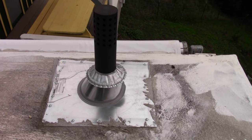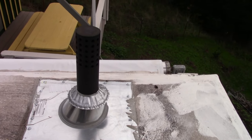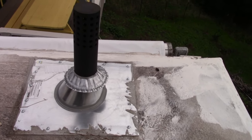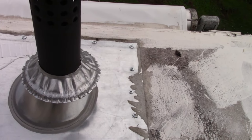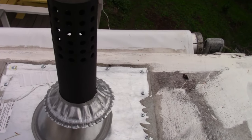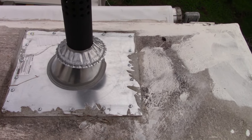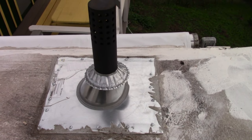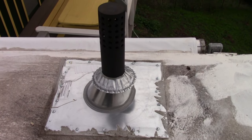This is how the stove pipe is flashed from the outside. I have extra lengths of pipe I bought but haven't needed and don't plan on using at this point. The storm collar was a little bit loose and I had to crimp it, and I haven't caulked it — haven't needed to — and it's been raining. A little water is probably getting down there when I'm not here and not burning the stove, as there's evidence of drips, but when the stove's going and it's raining it hasn't been an issue at all.